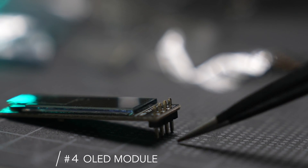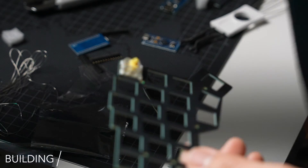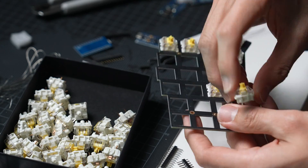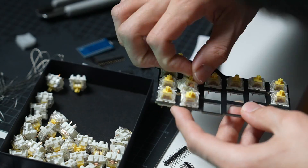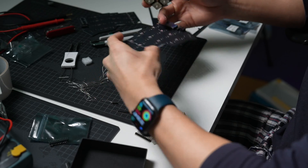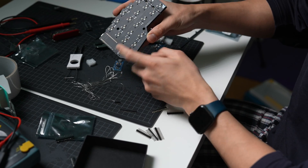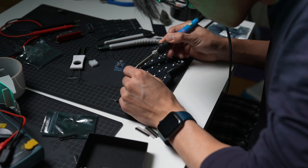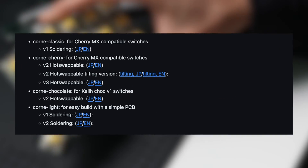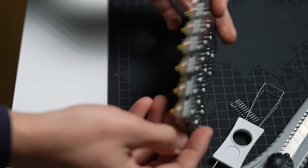Then we will solder the OLED display modules with the male connector pins for both sides, and in the end you should be able to slot them onto the PCB. Next, we will install all of the key switches on top of the top plate for both sides. I went with Gateron Yellow Pro switches, previously used on the EpoMaker TH80. Carefully insert all the key switches in place. Then place the top plate onto the PCB carefully, as the pins on the key switches tend to bend if not inserted firmly. Begin soldering the key switches onto the PCB for both sides. If you want hot-swappable key switches, look at the Corn Cherry V2 or V3.